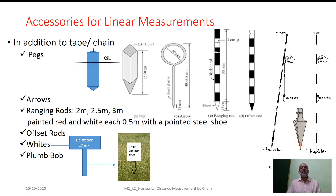First, you have to understand the various accessories that are useful for linear measurements while carrying out land surveys. The first and foremost task in surveying is to fix the position of the station. The means we use is a peg — it could be a steel peg or a wooden peg — which needs to be driven into the ground to represent a particular station. It is provided with a small mark or sometimes a nail can be driven. Here what you see is a wooden peg; the bottom is sharpened to insert it in the ground.